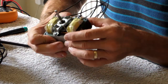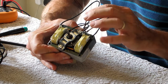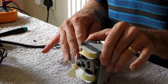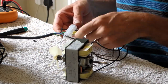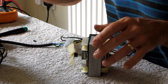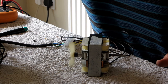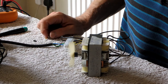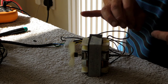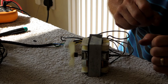Time for my final check. I've got the coils with their insulating tape — and these were varnished inside as well. The lead-outs are done, there's insulation over the lead-outs. I've just staked these pole pieces in lightly so I can test it. I've grounded the frame for safety, joined the two central parts on my circuit, and I've got my live and neutral feeds. And sure enough, that's running. Now I can be sure which way around these coils go — I've got the correct rotation which is anti-clockwise. All I've got left to do is drive these pins in and properly secure the pole pieces in place, and my motor's done.